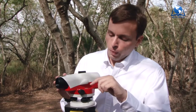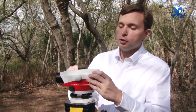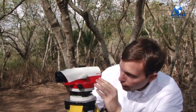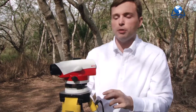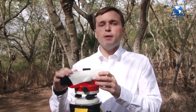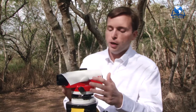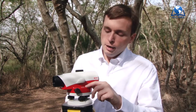Our last piece is the bubble on the instrument. This has a small mirror, so it projects the zenith-facing bubble to the vertical angle. When you're shooting the instrument, you can look slightly to your left and see the bubble also. This is extremely important — if your bubble somehow moves, you will not be taking accurate or precise measurements. So every time you take a shot looking through the telescope, simply glance over at your bubble to make sure you're still on the level plane.